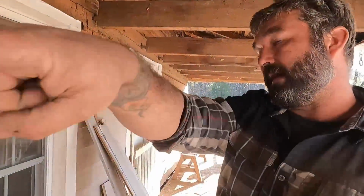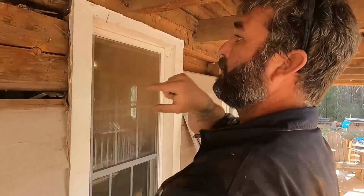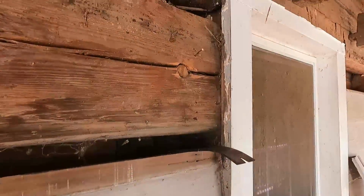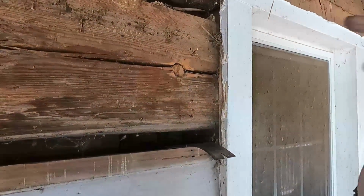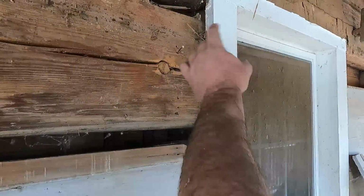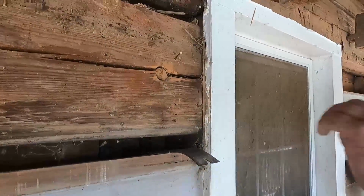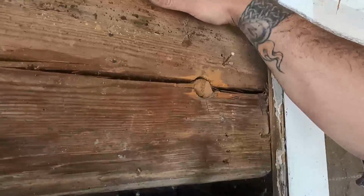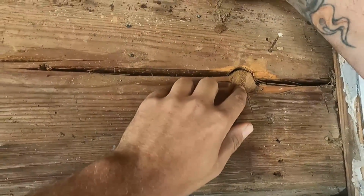They just wanted to add, when they added that door. Oh, they added a hallway. Yeah. So they didn't have lag bolts and stuff like we have now. So they built the wall frame inside, drilled holes, probably with a hand drill, and then hammered dowels through it. So this is why it's supporting the inside wall. Gotcha. For what is now the living room.